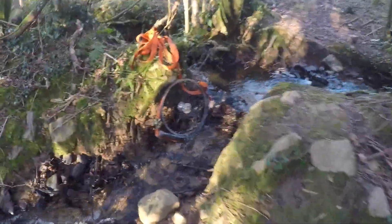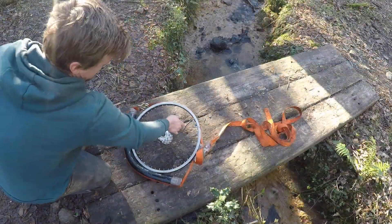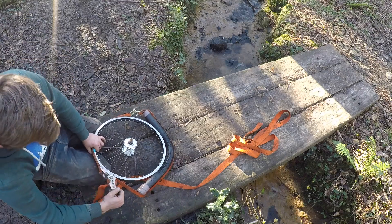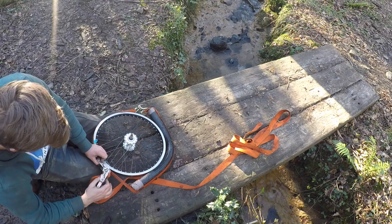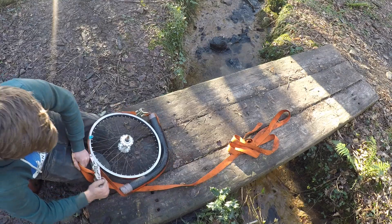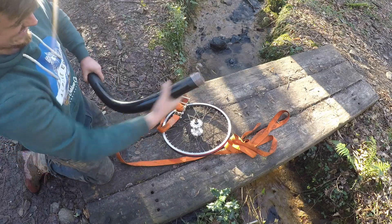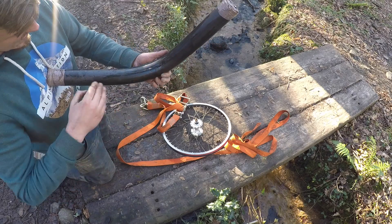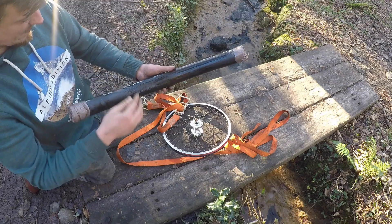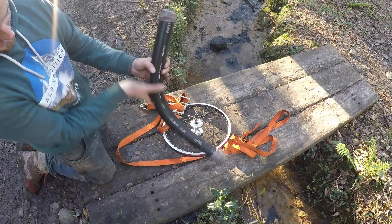It's a couple of hours later and now it's cooling off in the stream. Hopefully that'll make it set. We'll take it out of there now and see how much it springs back. Let's undo this and see how much it moves. There it is — perfect! How about that? I burnt it a little bit under here, but only a millimetre or something. I'll probably just melt those back. I'd say this has only got a couple of bar in it and this is a 12 bar pipe so it's not going to burst. But it worked — check that out. Nice curve.